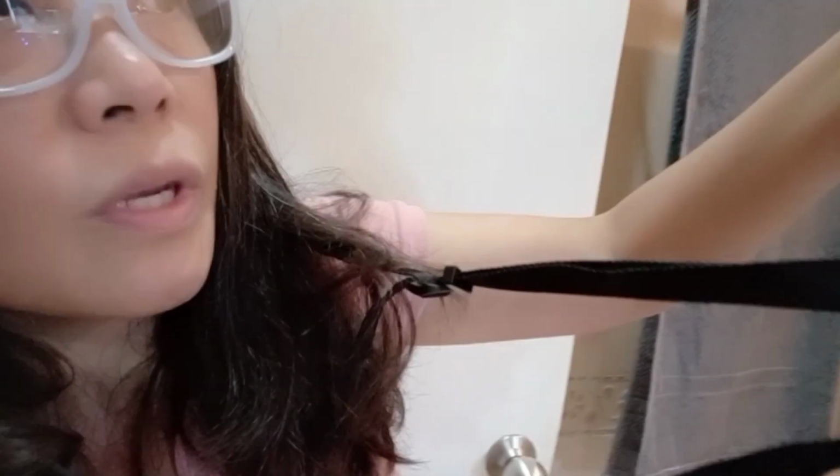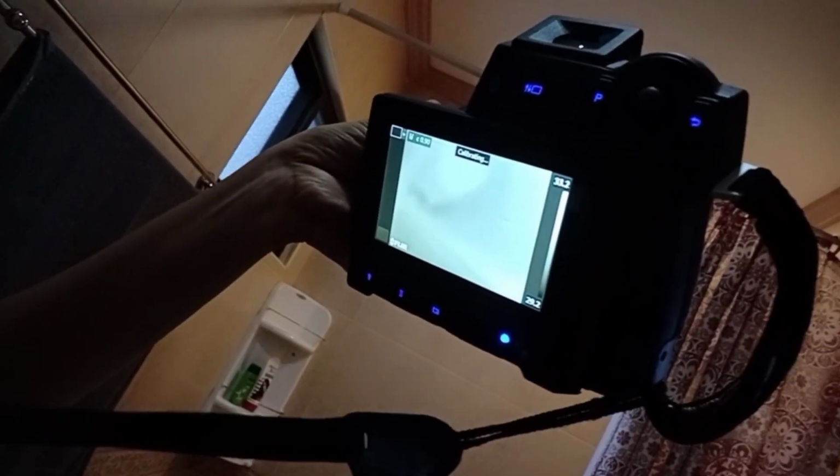So I'm entering a room now. It's a bathroom. So visually, the ceiling looks perfect. No watermarks. All fine. Paint condition is still good. No problem. But that's why I'm making this video, because I saw presence of moisture which was not repaired properly when we had this roof painted and patched for possible holes. So you spend big money but your problem is not fixed, only until you discover that there is still moisture.